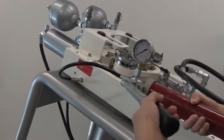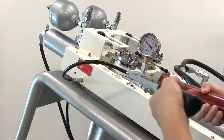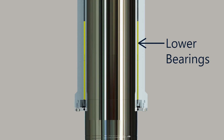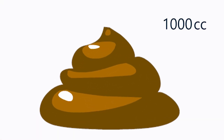This greasing principle is different from our manual greasing procedure. When manually greasing the lower bearings, we pump the grease up to pressure to help ensure the grease moves down the bearing housing cavity to reach the lower bearings. We do this because we don't know how much grease has been washed out since the bearings were last greased — it might be 10 cc or 1,000 cc of grease needed to refill the bearing cavity.